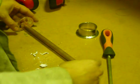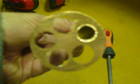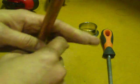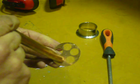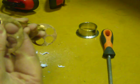Here I've finished filing out the holes in the baffles to fit the cooling tubes. And what I've been going for is a tolerance fit in there. The thing with either welding or especially soldering, silver soldering, is your solder or your weld is only as good as how close you can get your parts to meet.